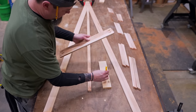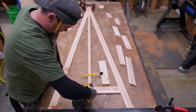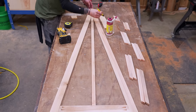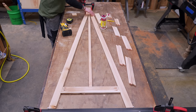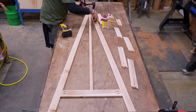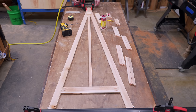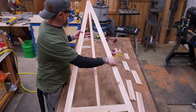With the bottom board installed, let's glue up the top. Add glue to all of the edges — this is where the two and a half by two and a half inch block comes into play. Add wood glue to the back, measure seven and a half inches down from the top, and install it in the center using seven-eighths inch brad nails. Once that's in place, throw a brad nail on each end. That is essentially the frame of our panel — looking pretty good.